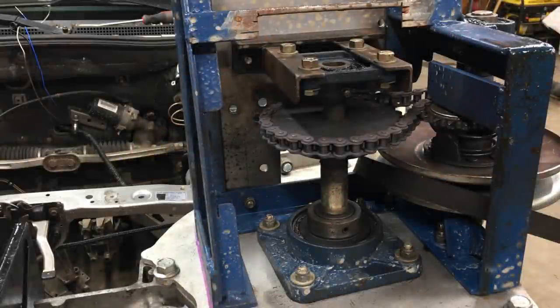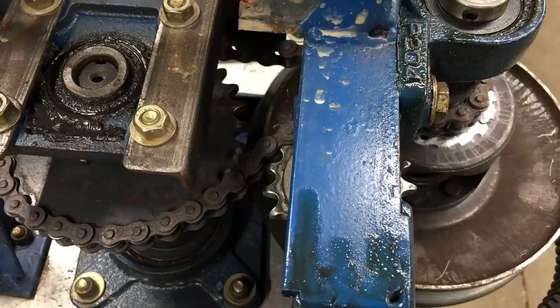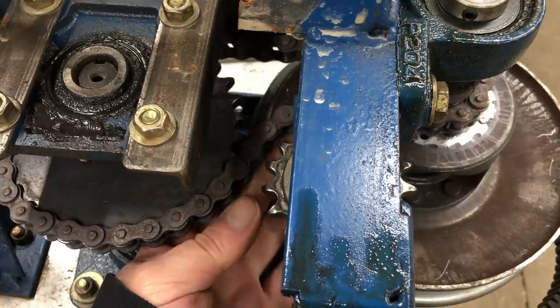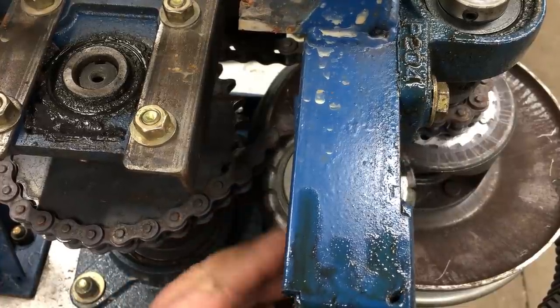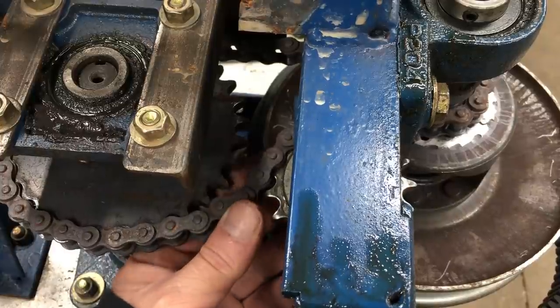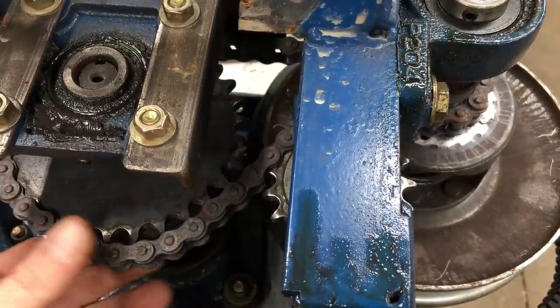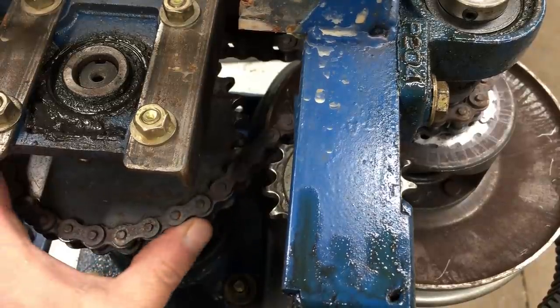Here's a shot of the bottom. This cradle's seen about a half dozen modifications in order to get the car drivable. Most of the mods were clean, but some were just downright hacks. My major concern moving forward is to fully sort out the chain drive and chain slack adjustment system. The system's very sketchy at best, mostly because it was hacked together at the last minute. It works, but it has a lot of issues. The idler sprocket is adjustable, but it won't actually hold an adjustment for very long.